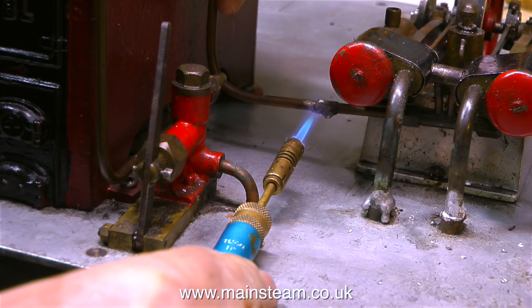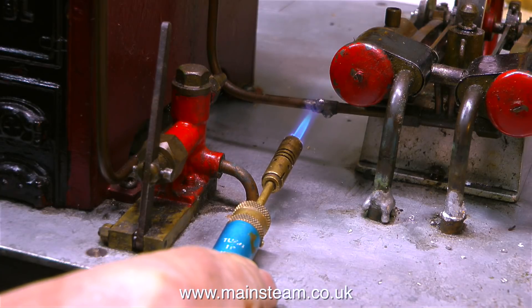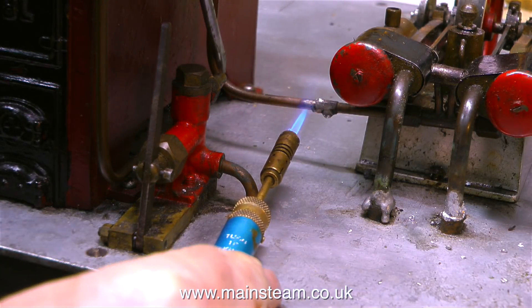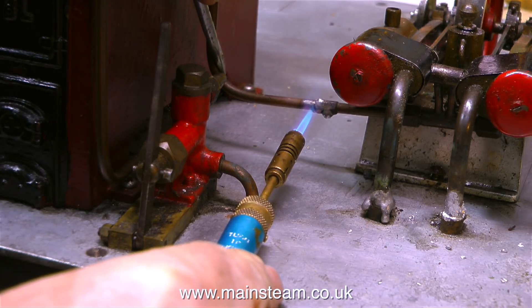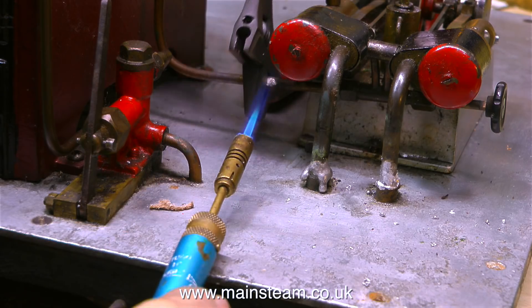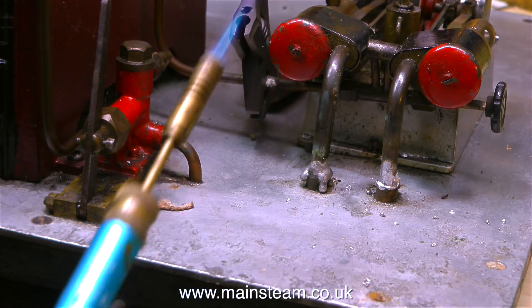The pipe from the boiler was also soldered to the engine pipe, and I could see that it was a nut between the two pipes. So I assumed that if I warmed up the solder with this mini blowtorch, I'd be able to undo the nut. And indeed, once the solder was melted, the nut did move.